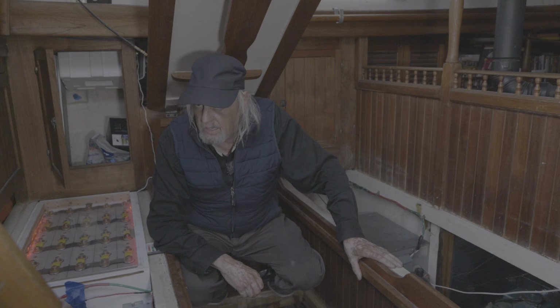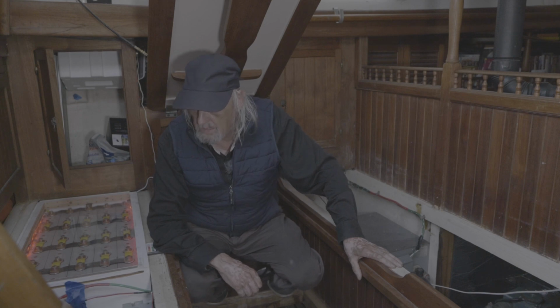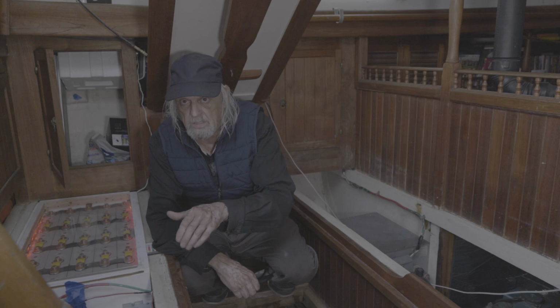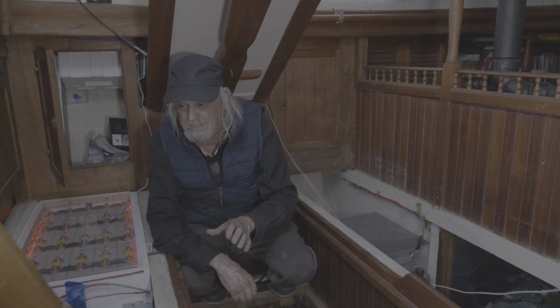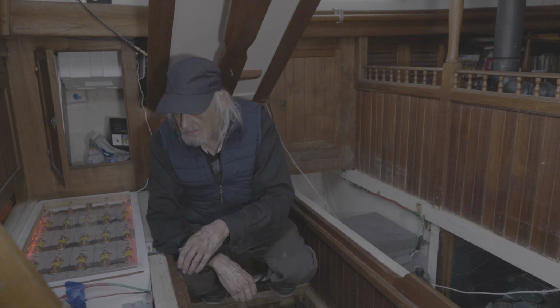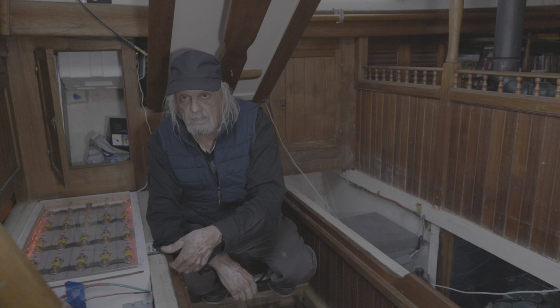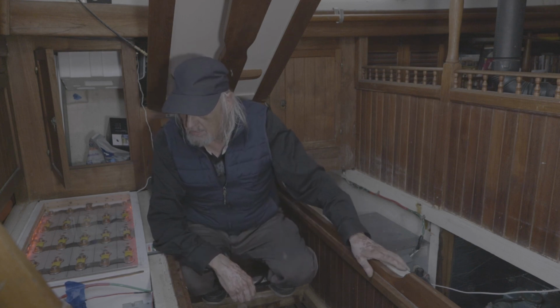I found the leak, and it was where I was hoping it'd be. One of the flanges was leaking, on the side towards the bottom. I could feel the exhaust coming out with my hand. I felt around everywhere along the exhaust looking for leaks, and that's how I like to do it, because you can't always see a leak visually, but I can feel the hot exhaust blowing out. So it's the flange itself.